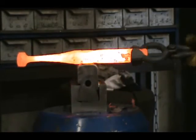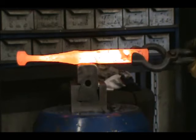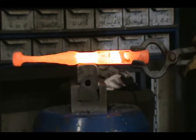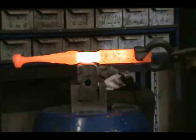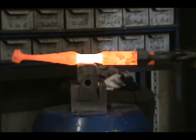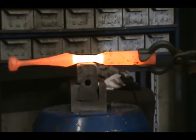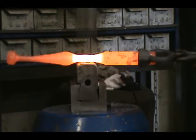Next, you can just spin the material without pushing or pulling, and the steel will push out either end of the dies as it is forged. It is good to note that feathering the throttle at the beginning will help you stay on track without wandering. This is important because once you lose your track, you will not be able to force it to become smooth again.